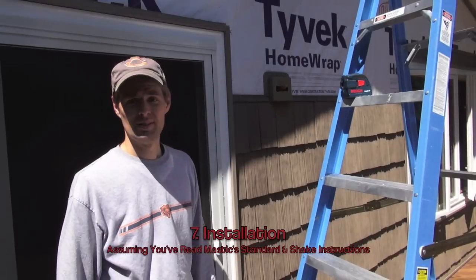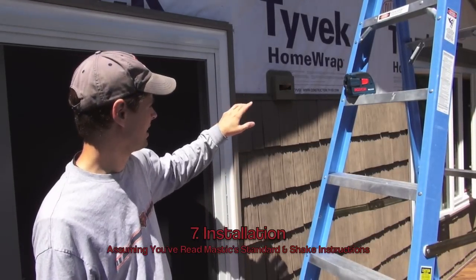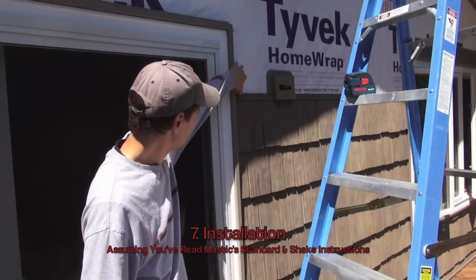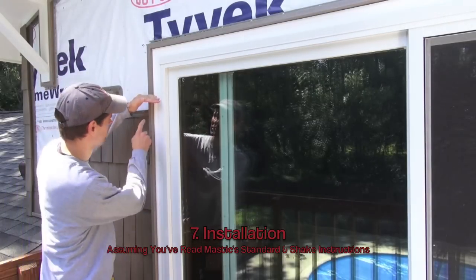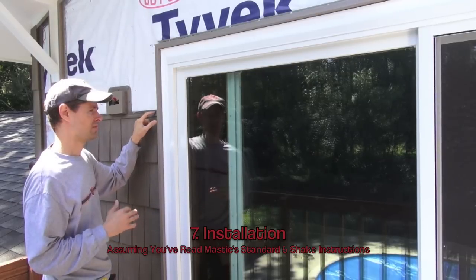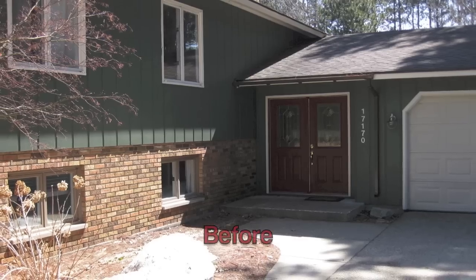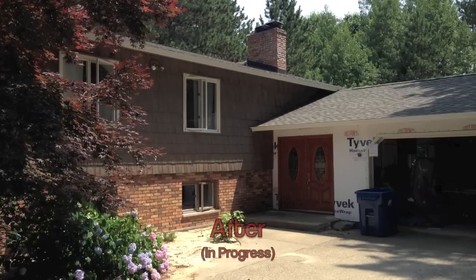In a lot of places here, I don't know what I would do without this laser level. On this side of the patio door, the line is just above the nail fin right there. If I put a little shade over it I can see it's right about here — it's about 5/16 of an inch lower over here than over there.